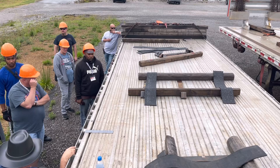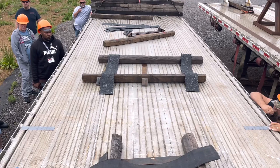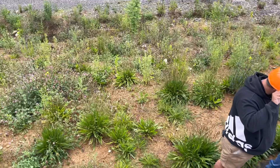You're loading three coils: load number one heavy center, number two heavy here, number three heavy here. For four coils: number one, number two, number three, number four — you just keep splitting it out. The reason for that is the spread axle trailer. You're allowed to haul 40,000 pounds on that spread axle.